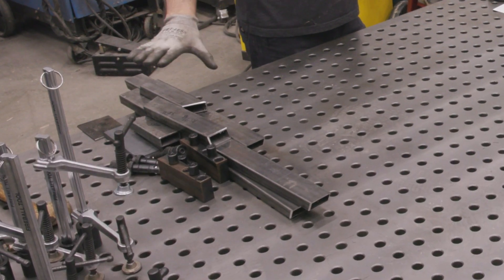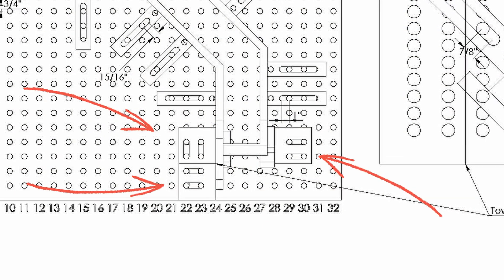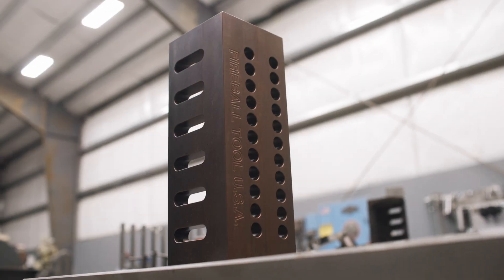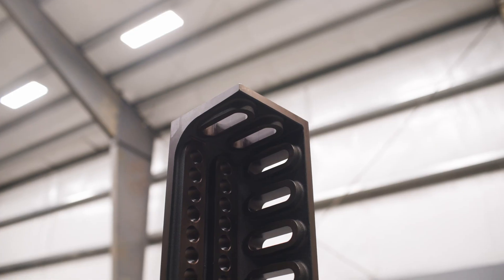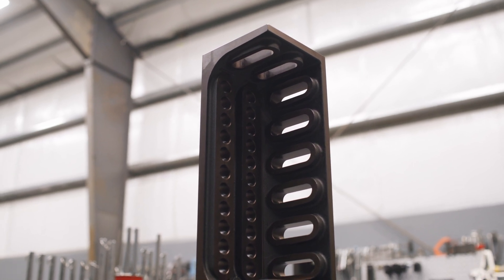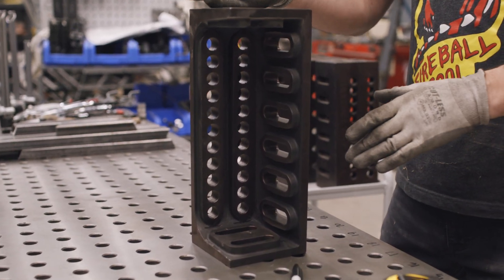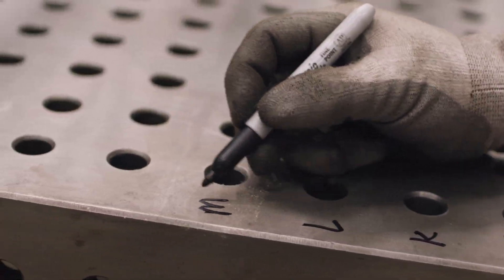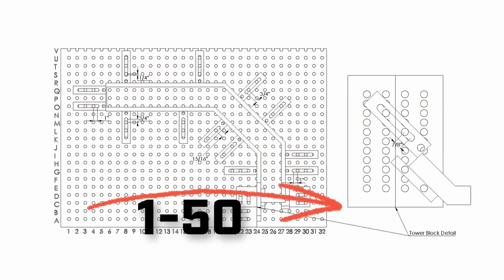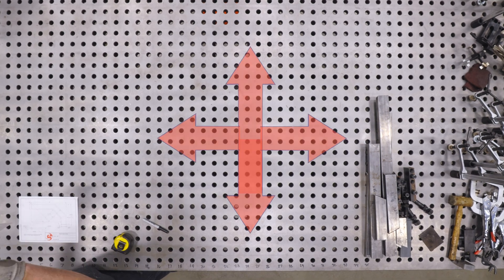Since I already have all my material cut, we won't be talking about that. Because we're turning up on the end of our little bracket, I want to set some tower blocks. This is a tower block — these are 14 inches tall, made of cast iron, extremely heavy, well built, all machined, and perfectly 90 degrees. They give me a sturdy platform to build off of in a different direction. The table has a grid of A to Z — 26 holes — as hole ID locations. Going the other direction, there are 50 holes stretching from one end of the table to the other, so I have a full grid.